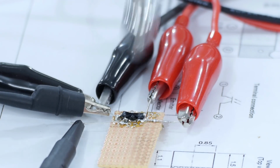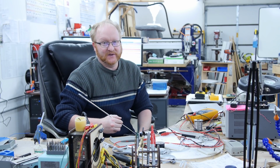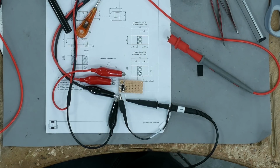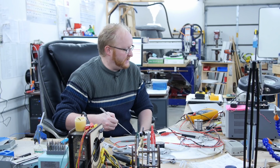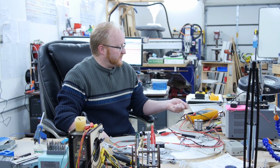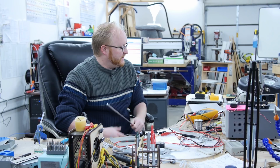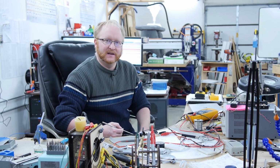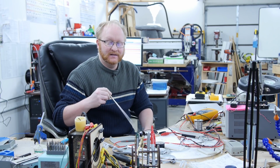Yeah, so we're looking at about 10 millisecond pulses here. I'm pretty sure we can see that even with the slower Arduino. I'll double check the code just to be sure, but this pair with the proper voltage and some sort of dark isolating block between them, in this case a piece of electrical tape, does give us a pretty good result. We have very close to 0 volts when inactive and then 3 volts when active with a pretty good pulse. It's a short pulse, but it'll be enough. Basically anything past 1.5 volts should trigger as a 1 on the microcontroller.